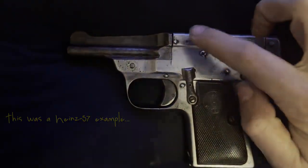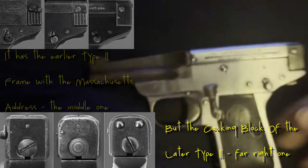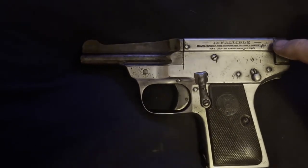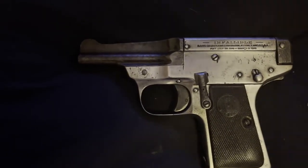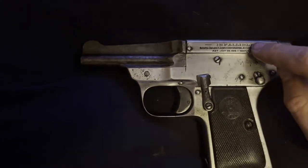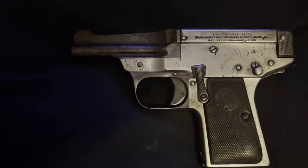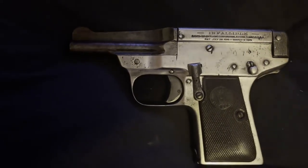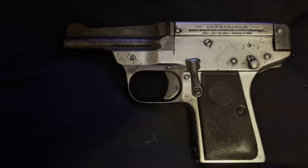I immediately knew because of this recoil system — up here there are these two humps, and back here there are two rods; it has a double recoil system kind of like an artillery piece. That channel is sealed and the springs are trapped inside it somehow, which I never did figure out how to get apart. The recoil system itself is okay, so it wasn't prone to moisture, but the striker channel maybe was. Given the patina of this piece when I found it, that spring probably just rusted in two spots and the weakness of the action breaking it made it a disabled pistol.